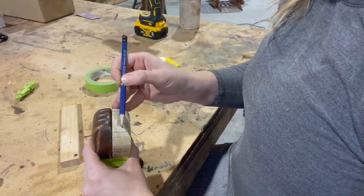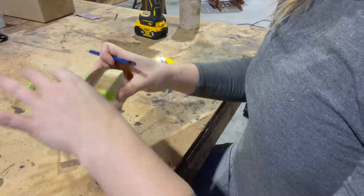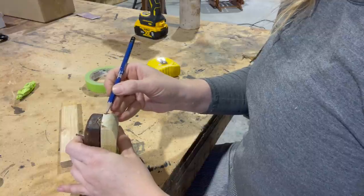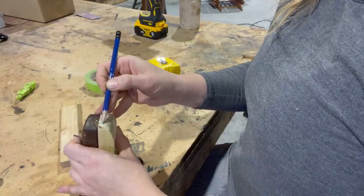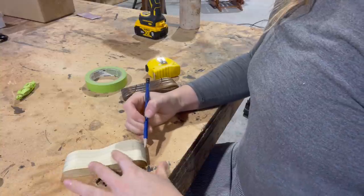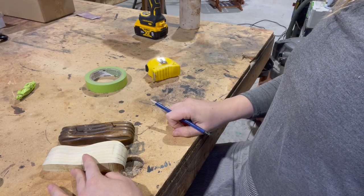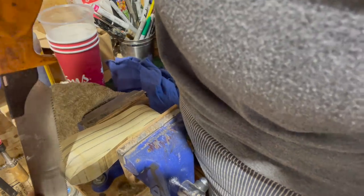This point way over here I'm just going to bring up. It starts kind of down a little back from the tip. I'll do the same thing on the back — just kind of a rough reference. Then I can take the tape off. I'm going to take a straight edge and bring these lines up a little bit so I can get my straight edge to connect. Now that I've got the lines sorted out, I'm just going to take my saw and start cutting in my grooves, going just past the tooth for depth.